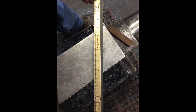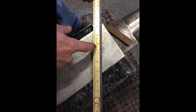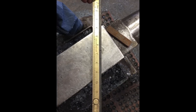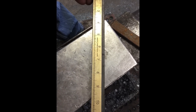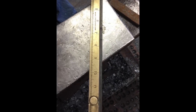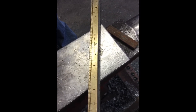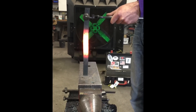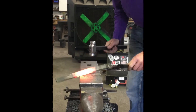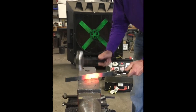We've got a piece thirteen and a half inches long and we're going to go about three-sixteenths of an inch off center. That gives us just a tad bit more material — about almost three-eighths of an inch more — on the outside, and we'll bump the center third. We want to make sure our bump overlaps our toenail because we'll be doing a lot of forging around that toenail, so we want to have some expendable material. We're just trying to get material in there that we can overlap into the fullering part of our shoe, so we want it to go past where our fullering mark is going to be.